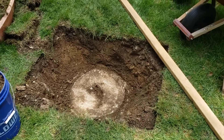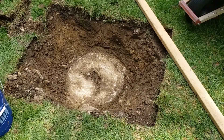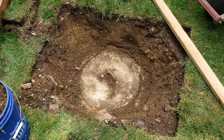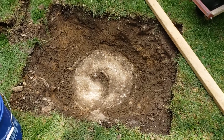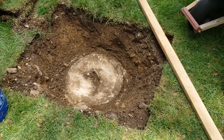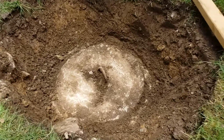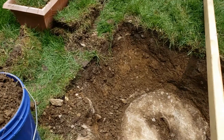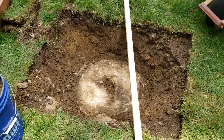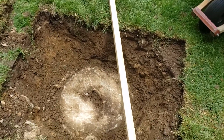For this project we're going to be installing a septic tank riser. Here's the lid of my septic tank. After calling the septic company to do the periodic pumping, they said they would not pump because the cover was more than 12 inches below grade. Apparently in the state of Connecticut, laws have changed and the cover must be less than 12 inches below grade.